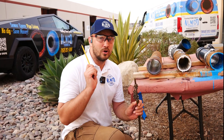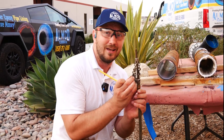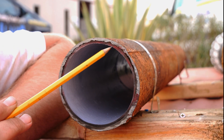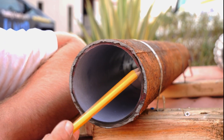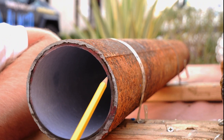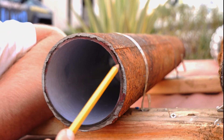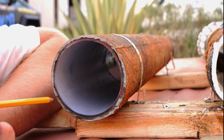We will do the same crash test on a CIPP epoxy pipeline with a carbide chain and see how they hold. Spray epoxy will have a little bit less thickness — about two to two and a half millimeters. CIPP has approximately up to three millimeters. But the difference is this epoxy lining is not attached at all to the cast iron pipe. Water can get between the new CIPP epoxy lining and the cast iron pipe — there's a gap. Water can get in, and hypothetically if the pipe has a crack, roots can grow in and try to collapse the pipe from the inside.